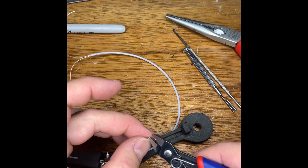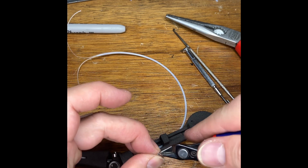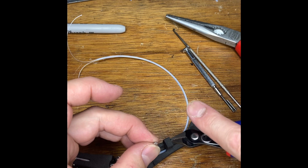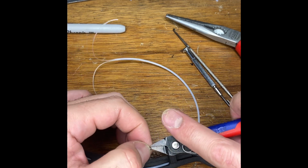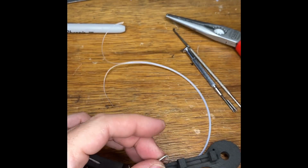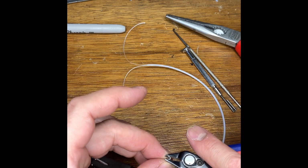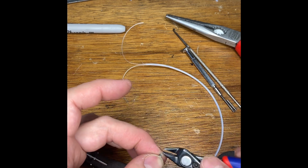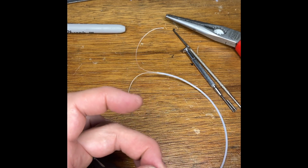Although this is a bit of a faff, I do still prefer it to elastic bands. Springs have a much better characteristic, and the real problem with latex, like a balloon, is that once it goes past a certain point, it suddenly gets much weaker. The springs have a linear extension. So the characteristic of the finger is better with springs.